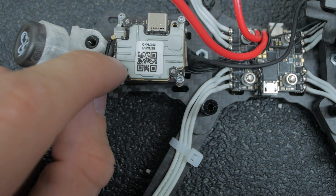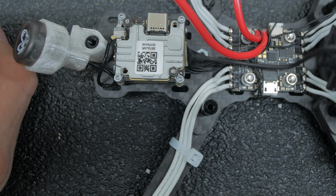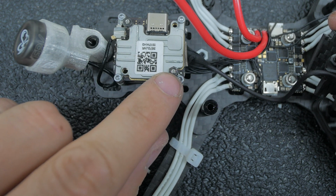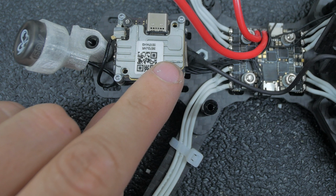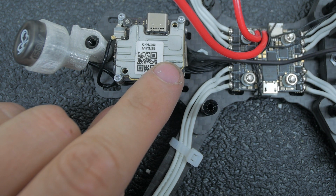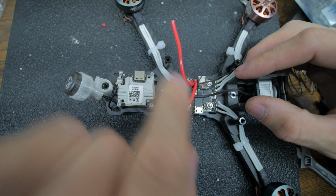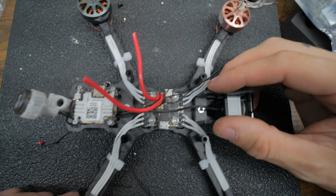I only run 2 out of the 4. I never really seem to have a problem. I don't really Loctite it, but I'll take some electrical tape. You know the electrical tape with the paintbrush? I'll paint that on just the very top. It makes like a little rubbery grip on the threads, and it can't really unthread itself. Maybe it'll come loose, but it can't unthread itself. I like that because it's not so permanent. It comes off in a peel, but it also holds things on. I'll do the same thing to these 4 bolts eventually. But for now, we got all that on.